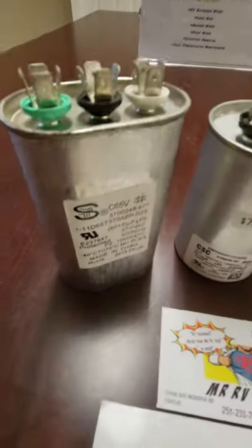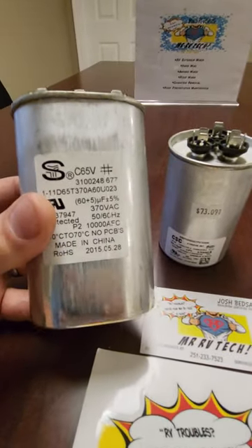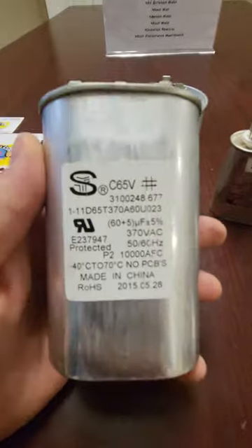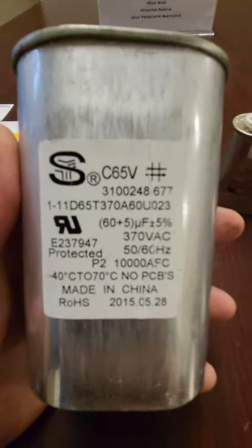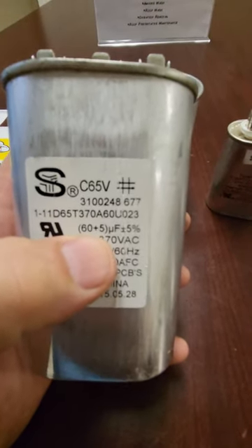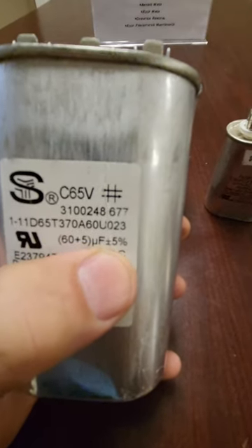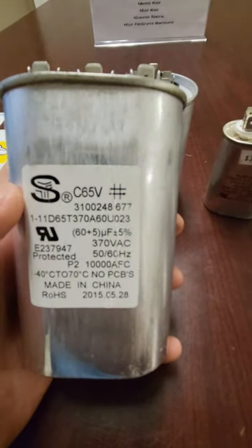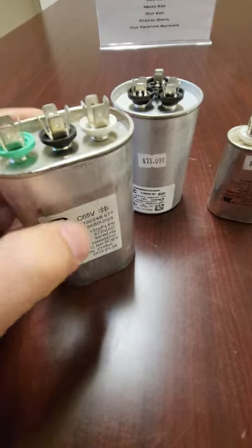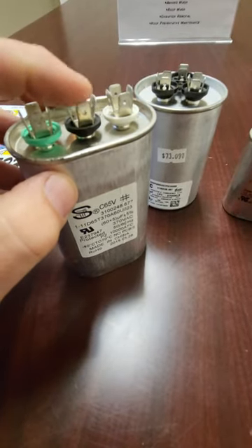So I brought three different types to the table. These ones are all good and I'm going to show you with a voltage meter how to test them, how to understand the label, and what you should be looking for, and also how to get a new one. In this particular example I'd like to focus primarily in this video on microfarads. If you look here, you see this number in parentheses — you have a 60 plus 5 microfarads, plus or minus 5 percent. What that means is the capacitance level of the windings in this capacitor. So in order to test them, I'm going to grab a cameraman and we're going to get a voltage meter up here.